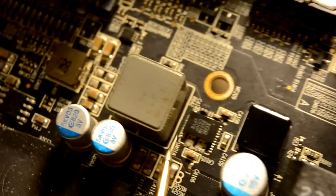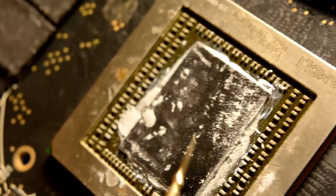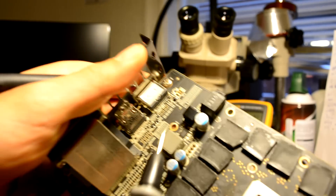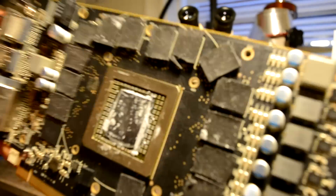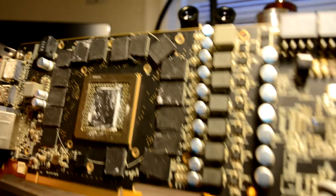The problem is on our memory controller phase. We won't be able to confirm the problem by applying 12V to see whether it heats up, because our top shoulder is broken off and those 12V would eventually go to our chip and just kill it. And 1V won't help because with that current we won't be able to feel anything. So right now let's take out our diodes and see if we have any differences. We just have to use our heat gun.